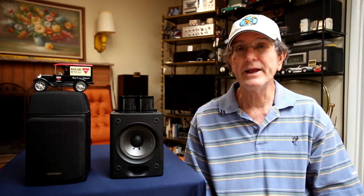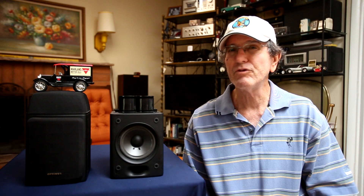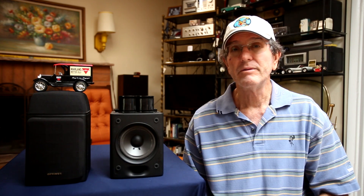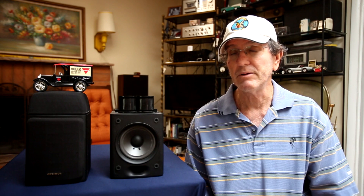After listening to a variety of music, I thought the highs were a little lacking — they didn't have the brightness I was used to. Earlier in the day I had listened to the Realistic Mach 2 loudspeakers and while the imaging on the LX5 II was better, the Mach 2 definitely had better high-frequency response. After listening, I pulled up the REW data and indeed there is a high-frequency rolloff on these speakers that starts at about 10 kHz.